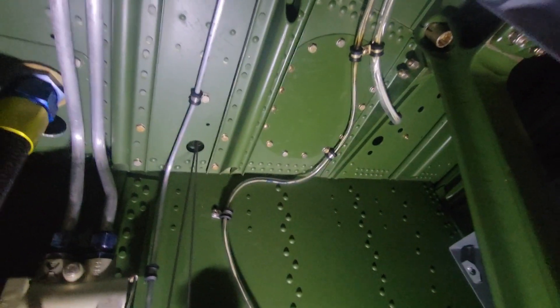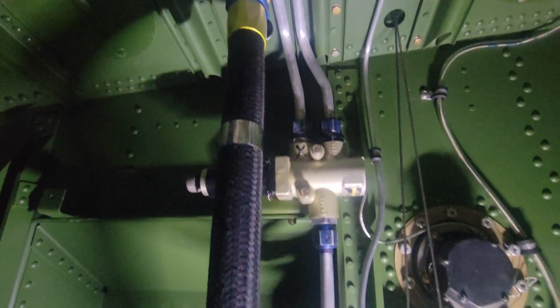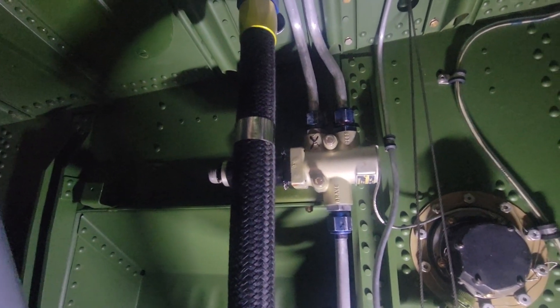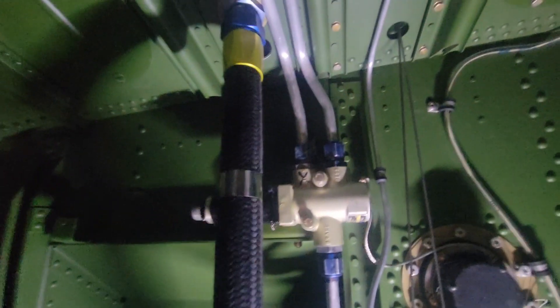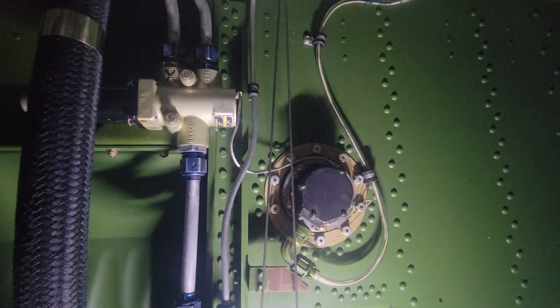This is the other cover, and this is a spar box. This hose right here goes down to the fuel selector valve. This comes from the auxiliary tank. This part here is an anti-skid device, which back in the day was rudimentary — it was added after World War II and proved to be not a good thing. So while it's still in here because of the piping, functionally it's returned to what Douglas had originally. There's the fuel quantity float.